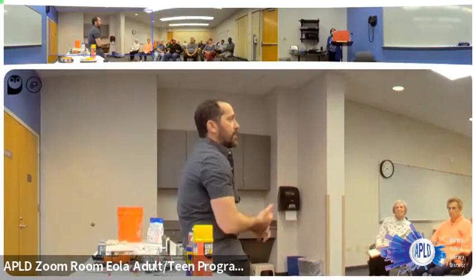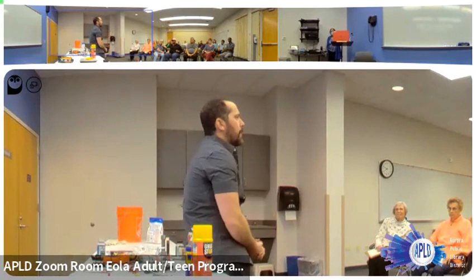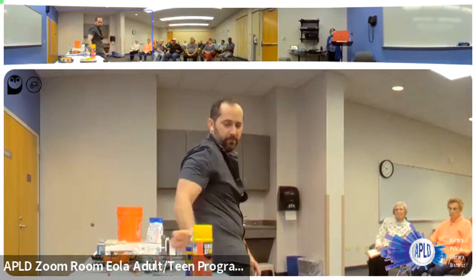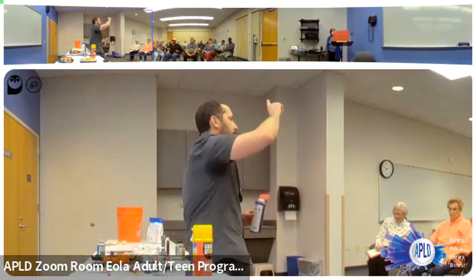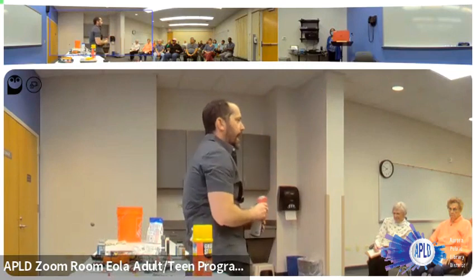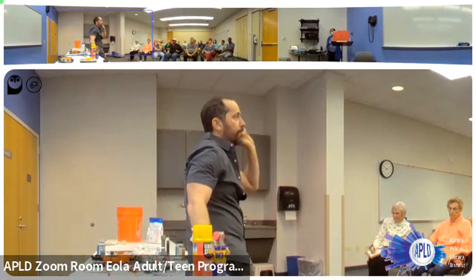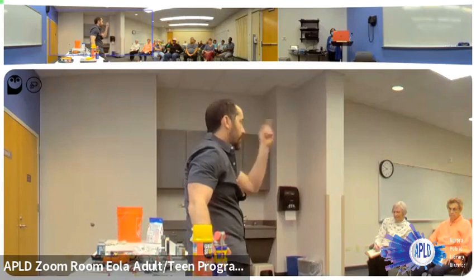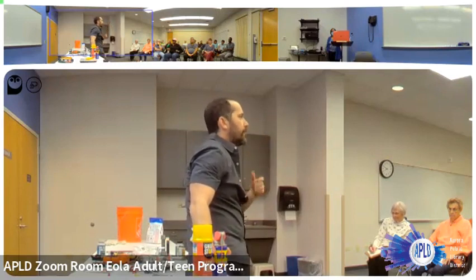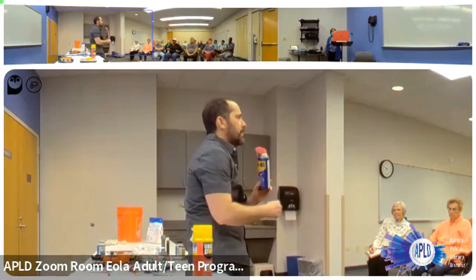Yeah, I was going to say, that's actually on one of the lists for me, things that you definitely should be doing yourself. Lube up those garage doors. They sell garage door lubricant, but this stuff's just as good. You want to spray the rollers. And if you have a chain, you want to grease the chain annually. If you have a belt, those don't need to be greased, and if you have a cable that winds up on a spool, those don't need grease. But if you have the chain, like the big bike chain, they sell chain grease that you want to put on once a year. Just follow the instructions. Super easy.